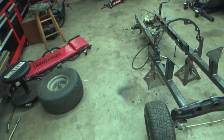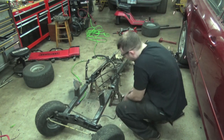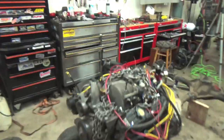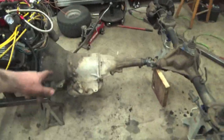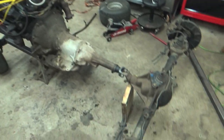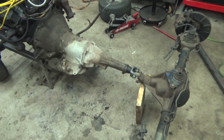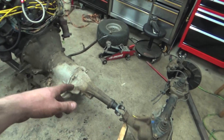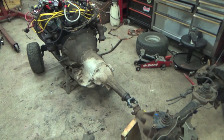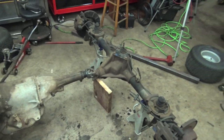It's going to be like a go-kart with no suspension — but that's how lawnmowers are anyway. You don't want suspension in a lawnmower because if you hit a bump, your grass would probably have a really low spot. So we've got the whole idea laid out: the 5.9 Magnum, the 904 transmission, and the Jeep rear end that will get cut down and shortened. This is probably the length the lawnmower is going to be due to the U-joint connecting those two, so it'll be a little stubbier. Maybe you guys know of a 904 that has a stubbier shaft on the back — send me a link to make this a little bit shorter. It's probably just a little bit longer than it originally was.